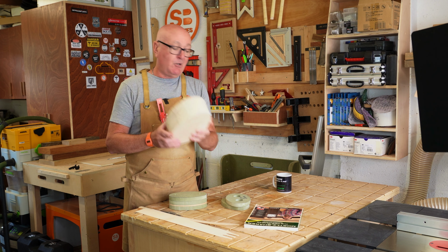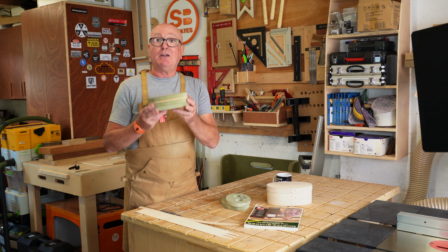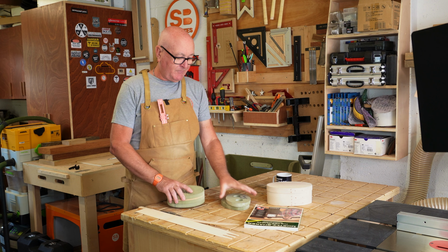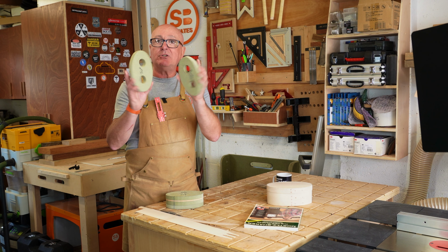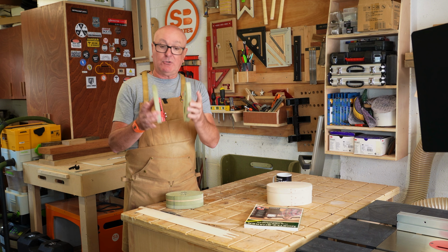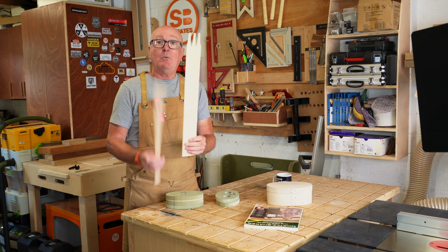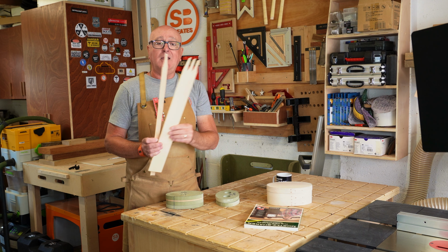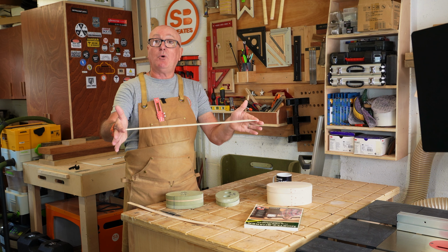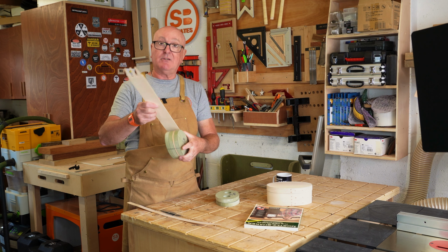But in order to make the box, we have to go back a few steps, because we first need to make a former so that we can bend the wood around to make the box. We also need to make two plugs we put in the end of the box once we've bent it, so that it can dry on the plugs. We also need to cut the thin strips with the swallowtails on. And once we've cut the strips, the Shakers used to stick them into a bath of hot water for about 20 minutes, take them out, and then bend them around the former.